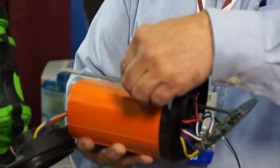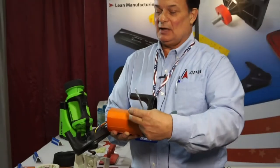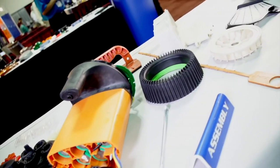These particular screws, which bonded the two parts together, were a $3 screw because they were custom made. What I actually did was redesign the plastic parts, made a shoulder, and buried the head of the screw to make a shorter, standard screw which you could buy off the shelf at any hardware store. Here at American Plastic, we want to mold your future and manufacture your success.